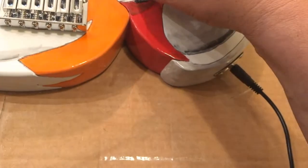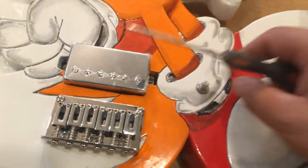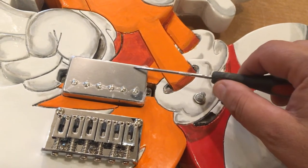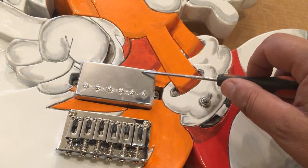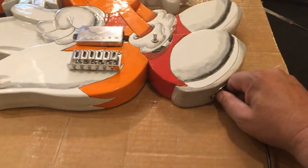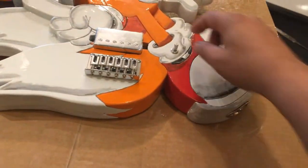All right, so successful wiring, and let me turn it all the way down again, and there we go. Let me show you all the way up. Both are active. Split the coil. Shouldn't get anything here. Nope. We get hot there. So, all right. Successful wiring, and it's easy to pull in and out the input, which is always a good thing.